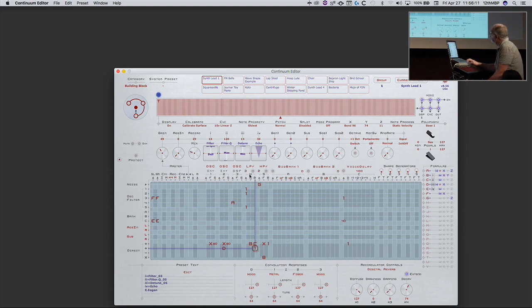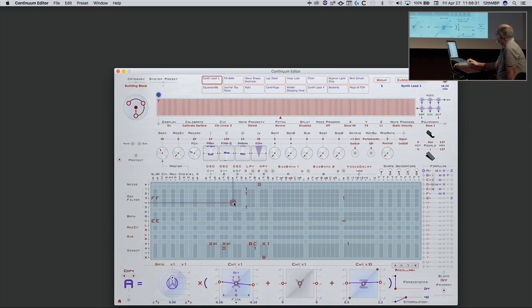So we have a low-pass filter that's probably 18 dB? It's three of them cascaded together. And then the output of that filter number four is going into the input of this oscillator, the audio input. And so in that case, it's acting as a wave shaper. It's actually 36 dB. Oh, 36 dB, okay, yeah. So anyway, let me play a bit of this.